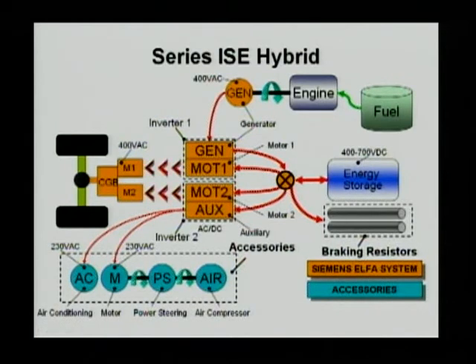Towards the left, you can see the two electrical motors. The two electrical motors are rated at 400 volts AC — they are induction machines in this particular design. The two electrical machines are connected to a common gearbox. Therefore, these two electrical motors are used to increase the driving power of the vehicle system. Apparently, the two motors are readily available from a vendor, so you put them together with a common gearbox to form this hybrid driving system. If you can find one motor rated at the power you need, that's fine too.